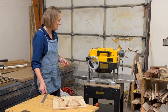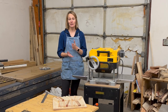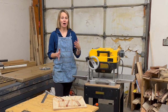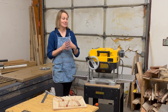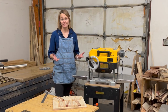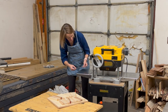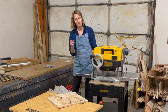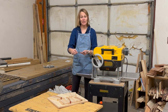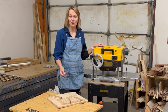The reason I do that is because underneath the machine, you have your two rollers, and then you have your spinning cutting blade in the middle. If what you send through the planer isn't long enough, it can get caught between the two rollers, it can damage the machine, and it can totally destroy your project, and can be pretty dangerous. So I raised the machine all the way up. I've got it unplugged, of course, and I'm just going to measure from roller to roller and double check my distance. That's about seven inches. Since this is seven inches and these were longer, I'm good to go.